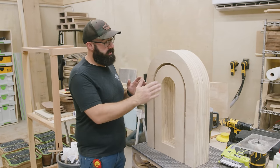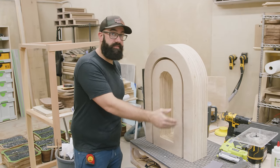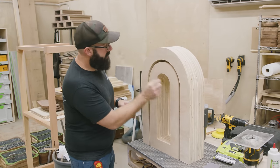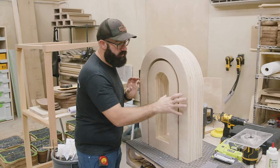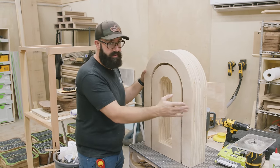What we're looking at here is this shape. This negative spot is going to be where our slats go for the actual body of this cabinet. And this is a 5/8 gap. So we have this form, and I made this 3 inches wide, so I had enough strength here for the clamp action. I didn't want this to bend or flex on me, so I made it 3 inches. I think that's strong enough.